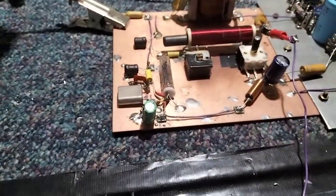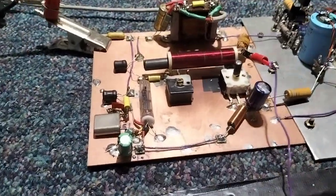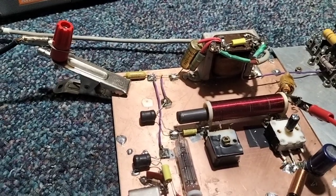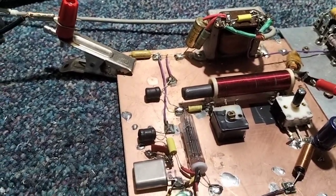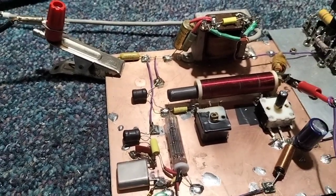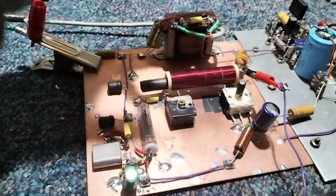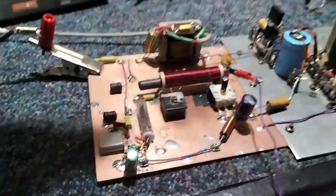The harmonics are virtually zilch on the second harmonic, and the third harmonic I cannot hear at all. So it's actually very clean. And don't forget, this is the way to do AM — this is how you're supposed to do it with a modulation transformer, although there are other ways. This is just a little cheap transformer out of an old radio that we've basically reversed, so the high-impedance side goes to the anode.